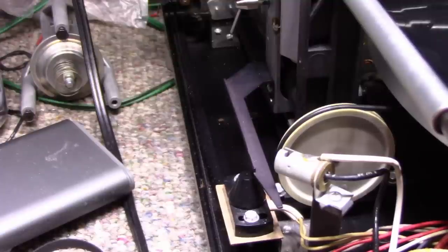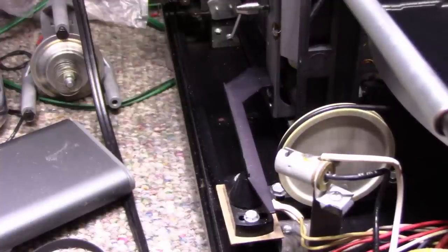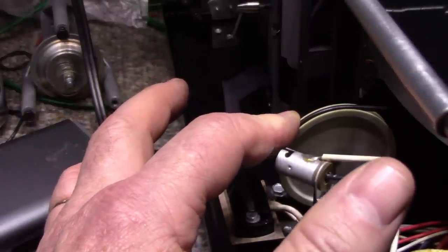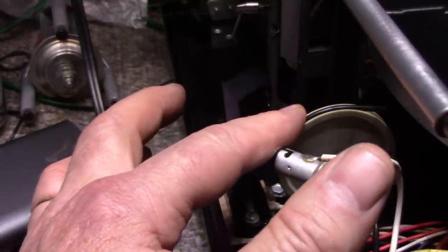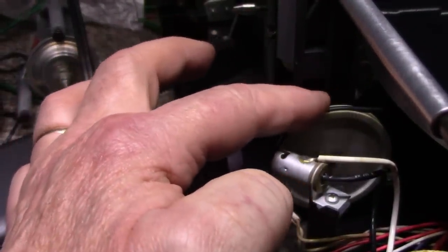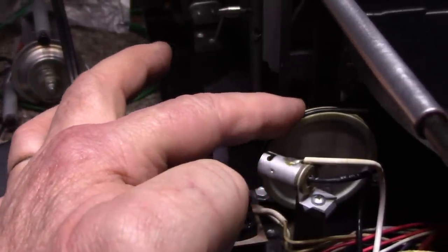Let's try this again. Let's watch it play through on the lead out of the album, and then you'll see it in action. Here it goes. See how, as the tone arm swings over, it blocks the light. But my belt does not have enough torque to lift the cueing lever. So I'm going to help it along here. It's not.